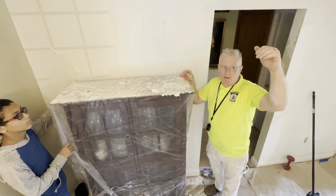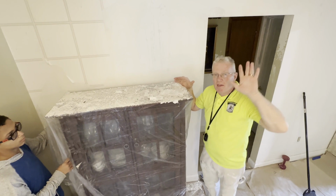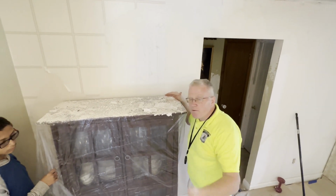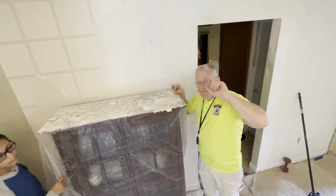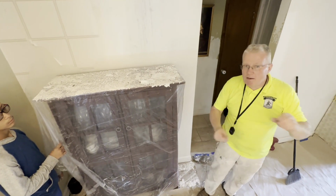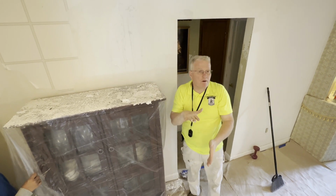You always want to start at the highest point. This is a mistake you can make by not cleaning in the right step sequence. When you're working on a ceiling, the aftermath of the work, which is the cleanup, must be done from the top down. For example, if we cleaned up the floor and removed the floor cover, but still had this to do, we'd be making a grave mistake, right? So, we started with sweeping the ceiling, knocking all of the mess down onto the chandelier, which was covered, down onto this, and then down onto the floor. Then we took off the chandelier cover, because that was the next step from the ceiling. And then as we come down, we get to this. This is our last level before the floor cover comes up.